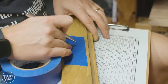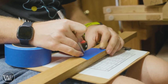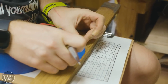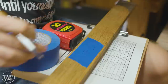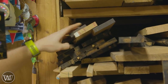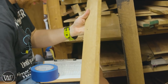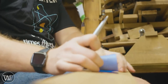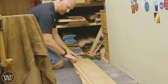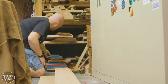Normally, because this is all in my brain, I'll write out a rough cut list — stretchers, top, back stretchers, legs — with very rough amounts. But because I drew this out in SketchUp, it makes it really easy to just pull out a cut list from there. I can number each piece and mark the boards: this board is intended for piece number seven and it's one of two, and so on. I can go through and make sure I have all the pieces. I'm going to pull out more than I need and put a sticker on every single piece notifying what it's intended to be.